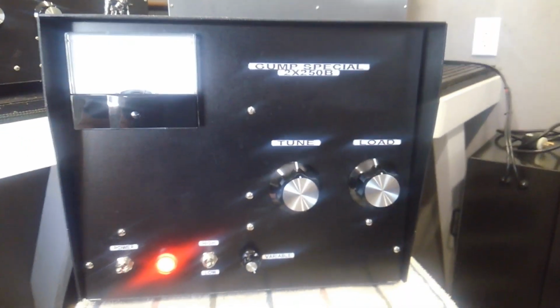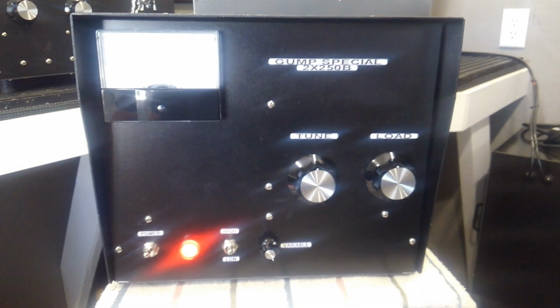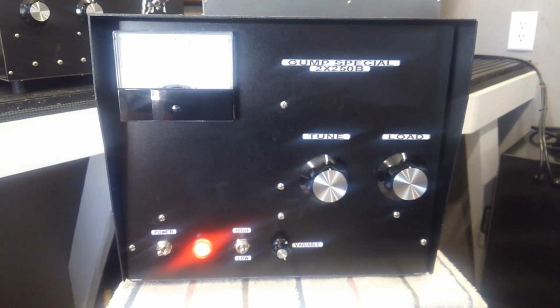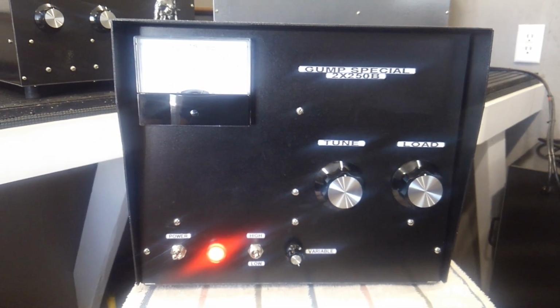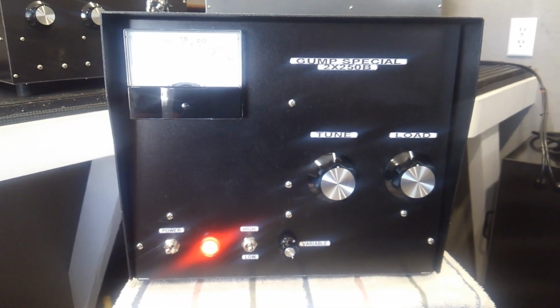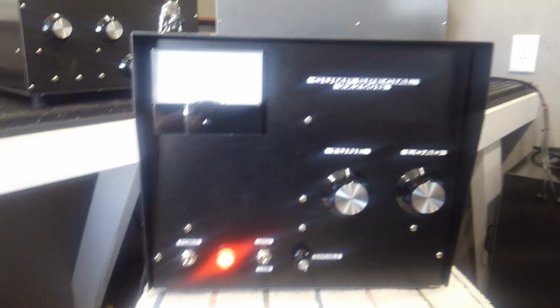This amp is set up for ideally a 7-watt radio, 7-watt bird average, and about 35 to 40 watts peak, but we'll say 7 watts to about 8.5 watts is your leeway on it. Anything over that, you're kind of taking a chance of damaging it. You may get by running it that way for a long time and not have any trouble, but it's considered overdriving it once you fall out of that parameter.